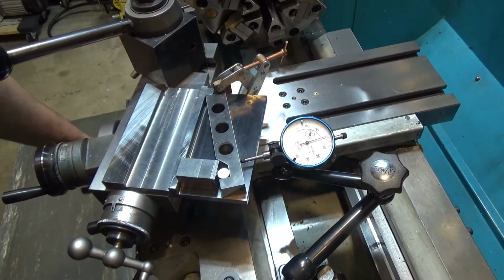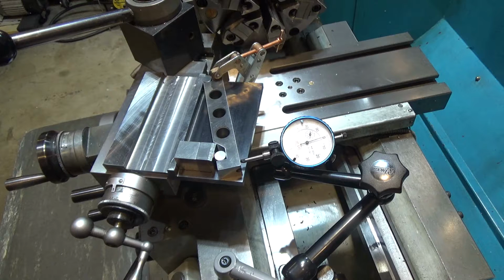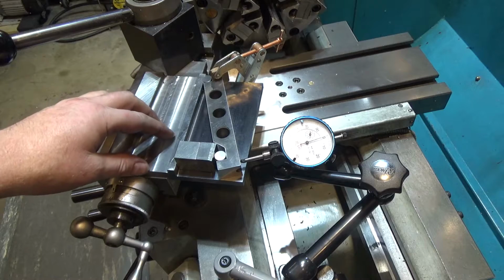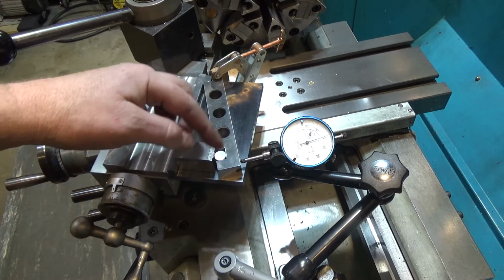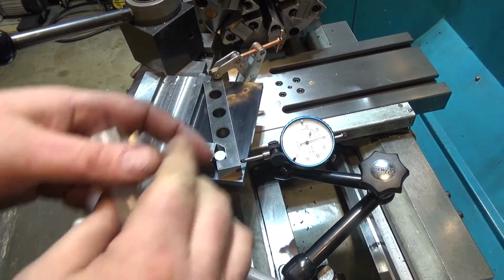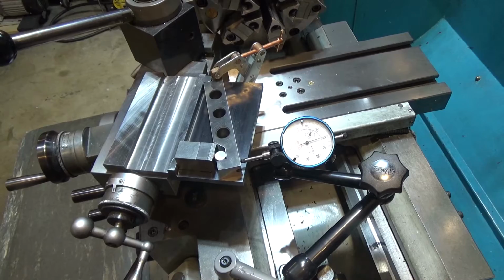And there we go. Across like 2 inches, we have a tenth or two, which means this is really close to 20 degrees. So this tool is working out pretty well. I'm very happy about it because 20 degrees would be easy. I could just set an angle block on the other fixture I made that I showed earlier, which is just this really small guy.